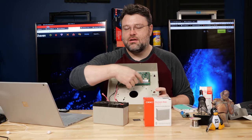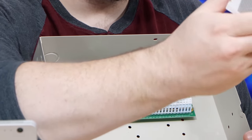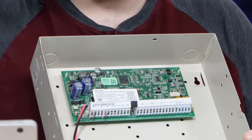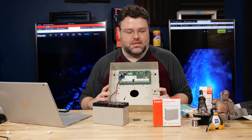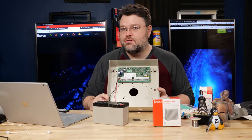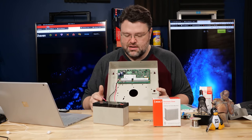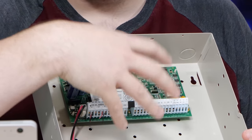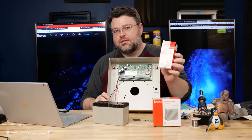This panel — from DSC (Digital Security Corporation) or Honeywell — has sensor inputs, programmable outputs, an interface for the alarm bell or siren, and an indoor or outdoor siren interface. It was originally designed for phone lines, but there are upgrade modules providing connectivity for alarm notification over the internet or LTE cellular. The GSM stuff is all discontinued; everything's LTE now, and it's actually less expensive. All of that plugs into a standard bus interface.